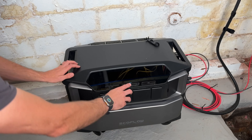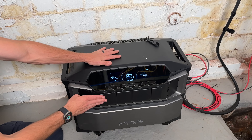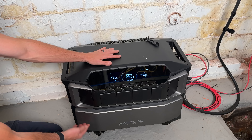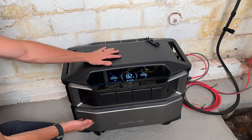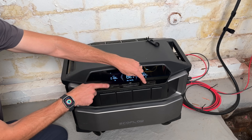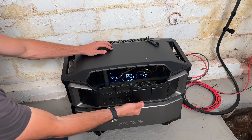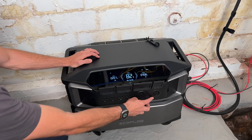First up is the Ultra. From a weight perspective, the top inverter is about 70 pounds and the bottom battery slice is 116 pounds. This one battery slice has six kilowatt hours of capacity, and you could stack a total of five of these underneath one inverter for 30 kilowatt hours overall. You have DC, USB-C, and USB-A outputs, plus 120V 20-amp, 30-amp, and 240V 30-amp outlets.